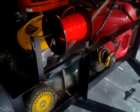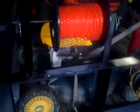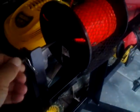What I did was I took some angle iron and welded them together. I took a piece of round bar and drilled a hole in the two legs of the angle iron, put the round bar through, and got two cotter pins — drilled the hole through the round bar.